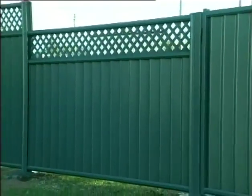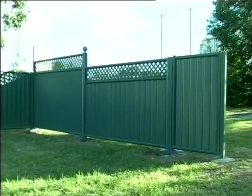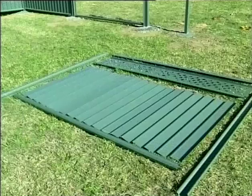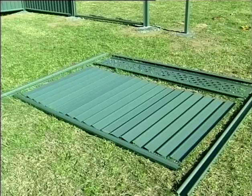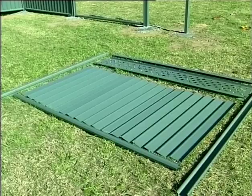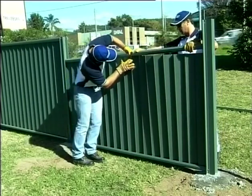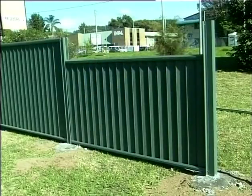If you have ordered a neater screen, smarter screen, or mini screen plus fence, then your post needs to be 300mm longer. To carry through our example, we want a finished height of 1500mm. There is 300mm for the lattice and 600mm post footing, so our post length will need to be 2100mm and sheet length 1190mm. You will also need one extra rail and extra screws. For a neater screen plus style fence, your fence post would extend 300mm above the top rail, which now becomes your middle rail.